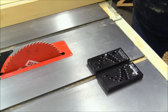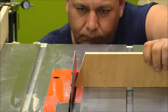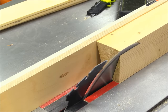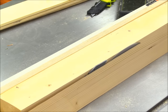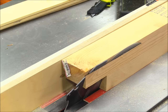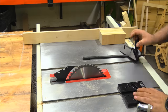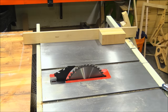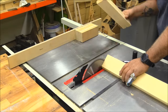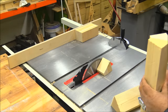I wanted to set my table saw blade to an angle that would complement nine segments. I used my miter set on the nine position, cut that piece out, and then used that as a gauge to set the angle of my table saw blade. Once I had that done, I ran the pieces back through the table saw and cut that angle — basically cutting wedge pieces to create the nine pieces of the vase going all the way around. I screwed a little block to my fence, then set the miter gauge back to exact 90 degrees, and cut all the pieces to 14 inches in length using the stop block and the miter gauge.